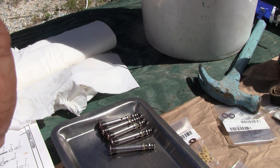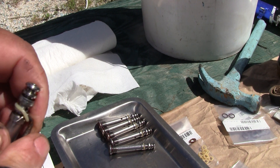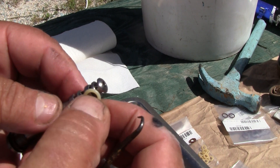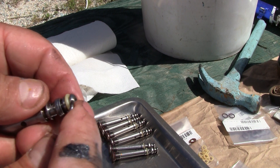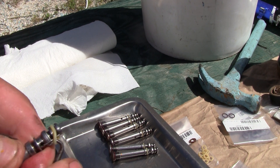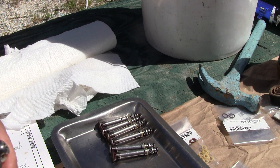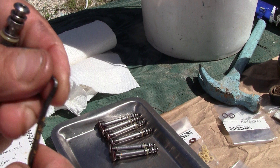Some of them are a little bit harder than others. You can stretch them pretty good — just roll it around. Some O-rings I got from two different sources; they're two different colors, which leads me to believe they came in two different boxes and might be two different ages. So you get that tool in there and roll it around. This is an exciter — when you push the plunger in, it excites the motor to get more pressure.